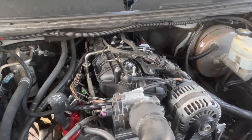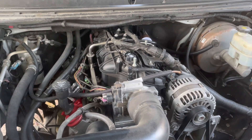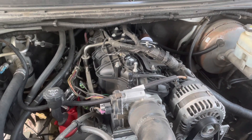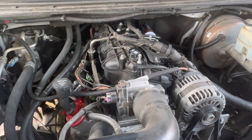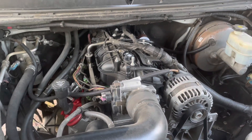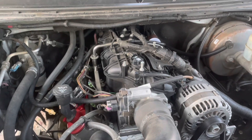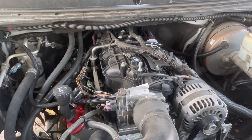I didn't bother to take them to the river and test drive them, and the reason was there's nothing I can do to adjust the fuel injection on the water. I can take it out and drive it, but if something doesn't work, I can't change anything on the water to make that engine run better. The only reason I would take a fuel-injected boat out on the water to test it is to make sure it doesn't sink — to make sure the exhaust bands and clamps are tight and it doesn't take on water through the exhaust system. Other than that, there's no reason to take a fuel-injected boat on the water, because there's nothing I can adjust out there. That's for factory applications — if the engine is specially tuned or it's a high-performance engine needing custom tuning, that's different. But if it's basically stock fuel injection, there's really nothing I need to tune on the water.